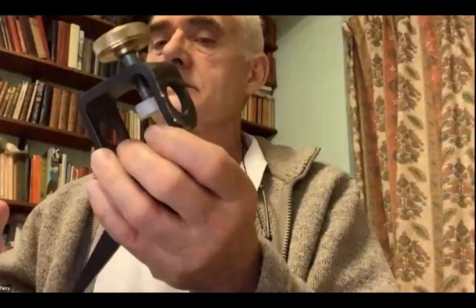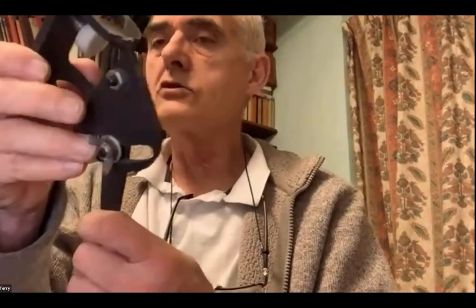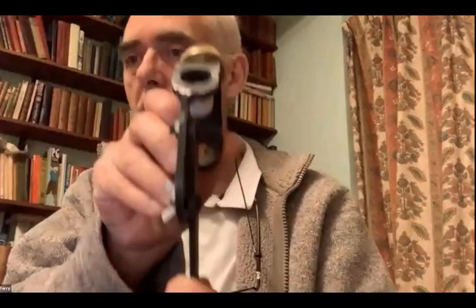Then you set the gouge in, put the jig on the Tormek. Doesn't matter what the settings are, set them at random. Then it's a process of iteration. I can't show you on the Tormek one, I haven't got it here, but you turn it over sideways. So the gouge wing comes down onto the stone, right? Then you black it up first for this process.